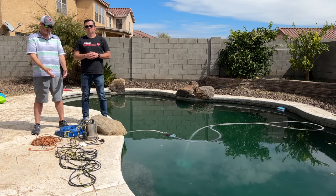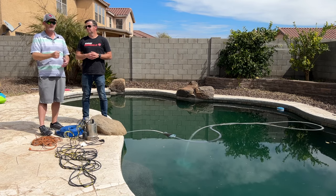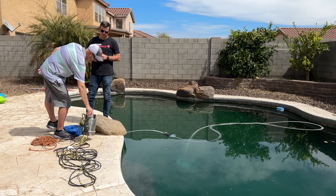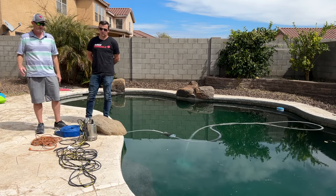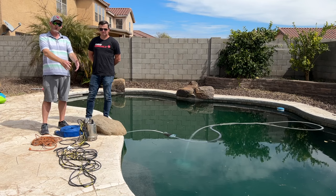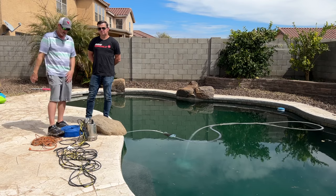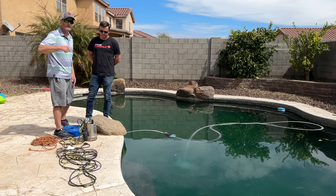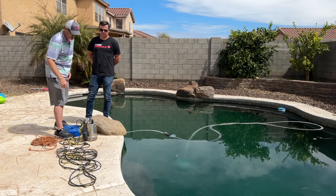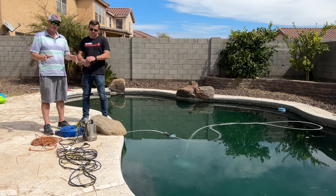You need some kind of a drain. You can rent these at Home Depot or pool stores. They have smaller ones that hook up to a water hose — they do work but take a really long time. One like this is a large pump, I think it's one and a half horsepower, and it'll drain your whole pool in like six hours. We usually start it before bedtime and let it run overnight. Put it in the deepest part of the pool, which is where your main drains are, and make sure it's upright. A big mistake people make is grabbing this by the electrical cord to put it in or take it out — that will break the pump. You need a handle or rope attached to it so you can drop it in and pull it out without destroying the pump.